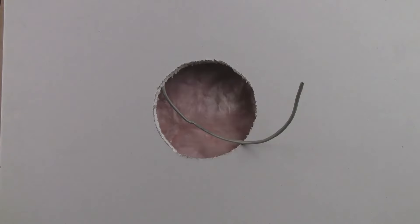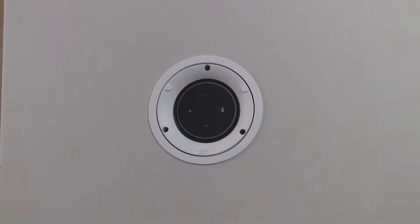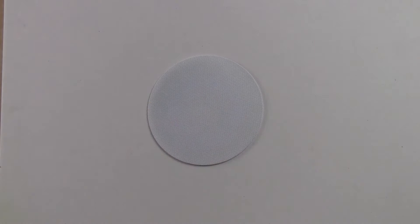Four: we highly recommend that you run a CAT cable from the central area to the center ceiling of every room where you might want to add a voice assistant like Alexa or Google Assistant. HTD offers a slick option for powering a voice assistant device and getting its audio into your whole house audio system, all over a single CAT5 cable.